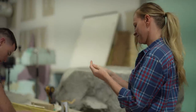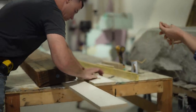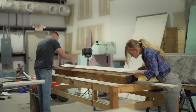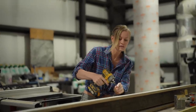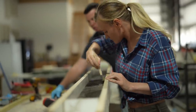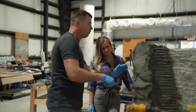Roll the clay into little worms and that will be used to make the mold leak proof. Screw it all together using a drill and apply a thin coat of mold release. Make sure you don't miss a spot. While this dries, it's time to tend to the vertical concrete project again.